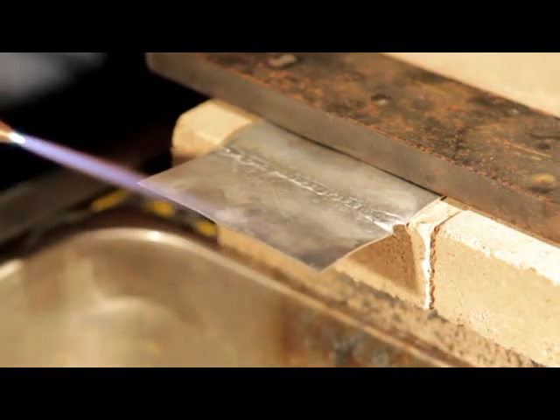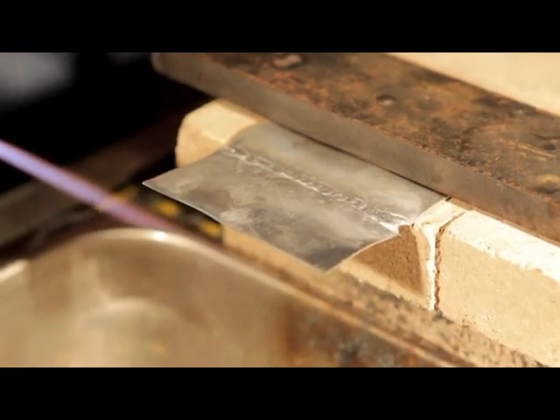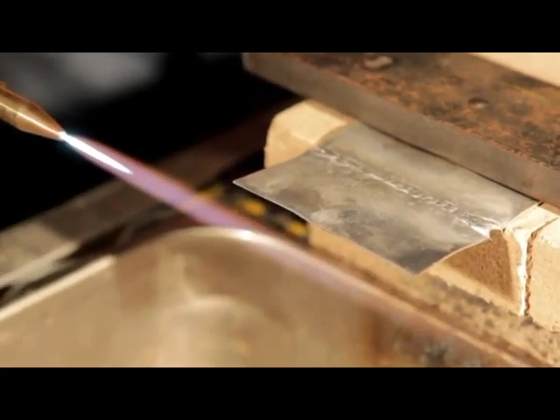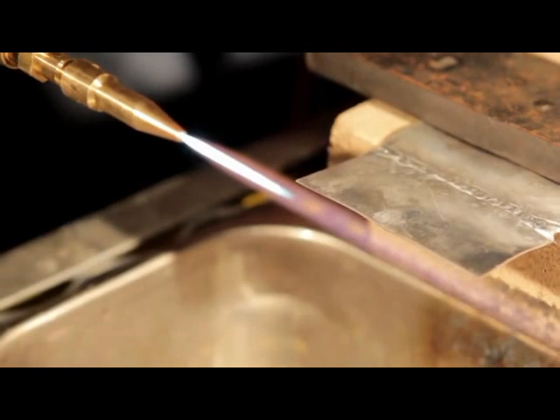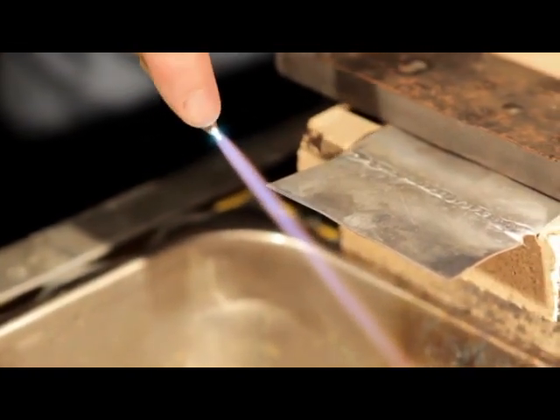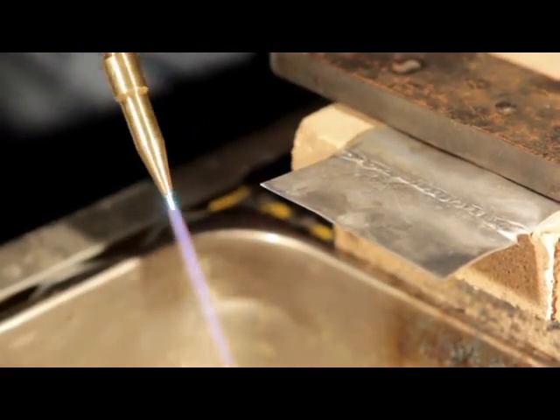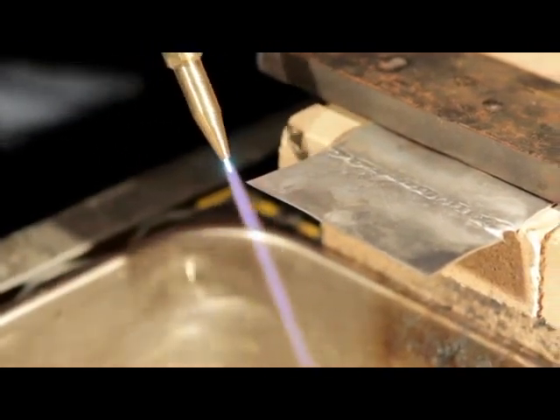Normally welding, I would have a much smaller cone on it. This is my zero tip for cutting that thin metal — I take that cone out as far as it'll go. Then I take the very end of that little cone, stick it in the metal, and just a little up and down motion. That's how you cut non-ferrous.